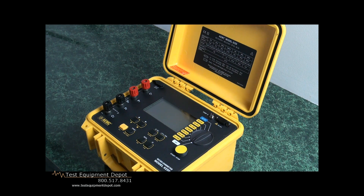This brings up another interesting feature: it can be set to automatically increment the test number. For example, if I have a lot of tests to do, I can be on object one and do test one. When I remove the leads and place them back on again, it will automatically increment to test two. Remove the leads, go to the next test point, and it will increment to test number three automatically — a unique feature of this device.